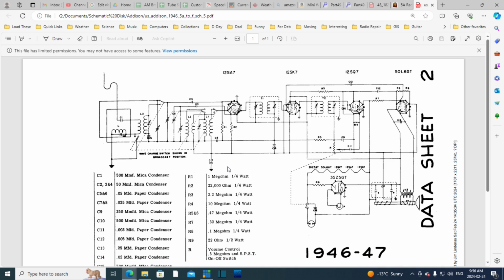So the capacitor still allows the high frequencies to pass through while providing a good enough reactance or impedance to a 60 cycle AC that if you're hanging on to the chassis, any power that gets to you through this is limited. So you might feel a tingle, and you'd certainly, if you short this stuff out, you see these funny little sparks. Very easy to see sparks, but nothing seems to happen, like nothing bad seems to be happening. That's because it's the charge coming in out of this capacitor.